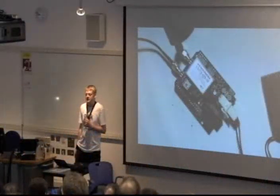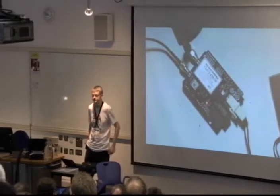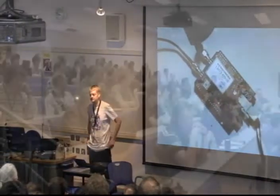So, do you have a question, James? I was just going to say, I suspect it's also about positioning within the payload itself. When people build a quarter wave, they add a bit of coax onto it, so it's away from the payload itself, the circuitry itself. And it's usually well positioned in the payload. Stubby ones sort of invite you to be really close. Yes. I think that's a fair thing to say. I think unless your tracker is designed to run a stubby.